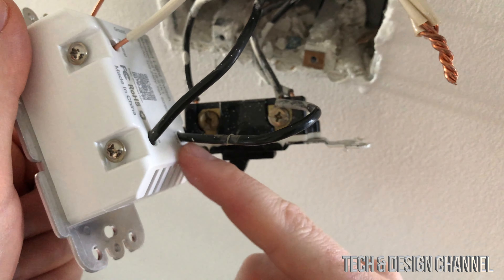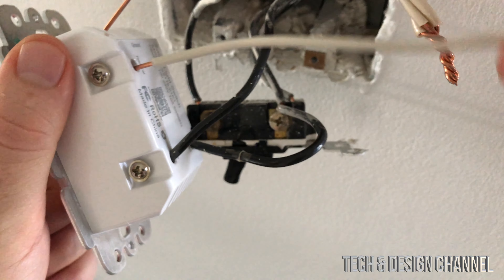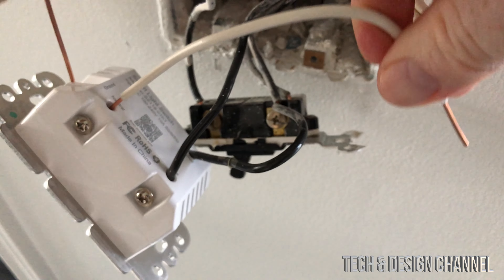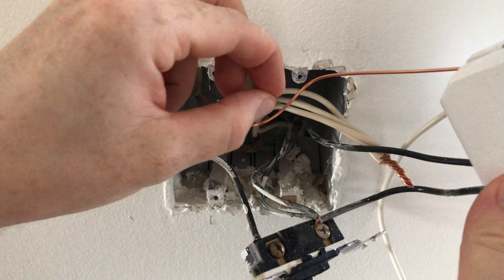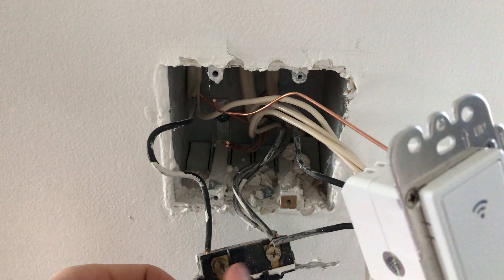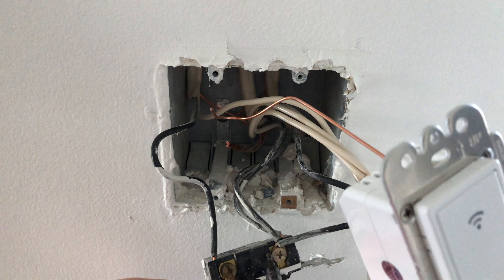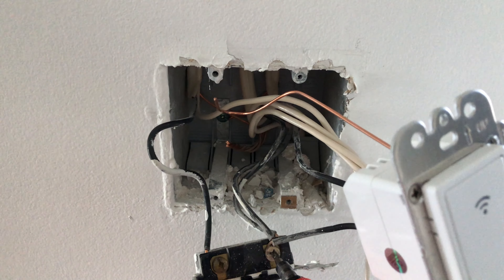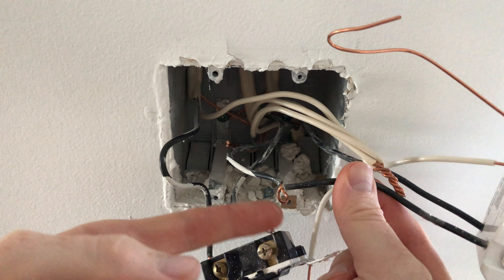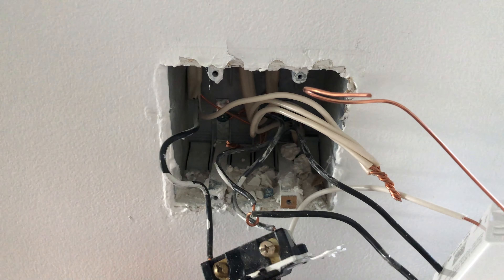These two are connected. For my ground, I just have to hook this up here, and the ground is on the back. I'm not connecting the ground just yet, and I'll leave the white cable for now — moving on to the other wires. We just take them out; this one is on the side so it's easier with a screwdriver. It looked like two cables but it's actually just one that went through and back up. We're going to do the same connection on the new device, so we have our cables loose and bring them up. My load would be this wire plus this one, and here's my live on the other side.